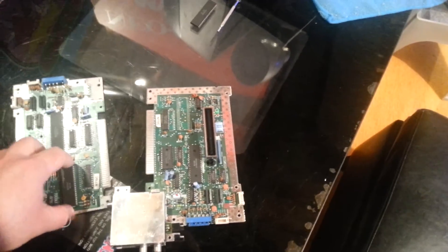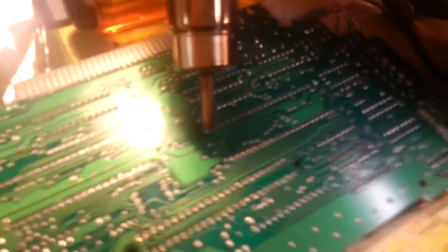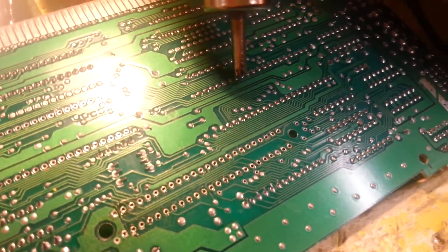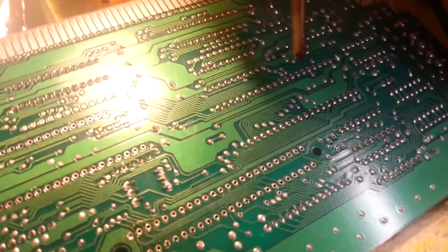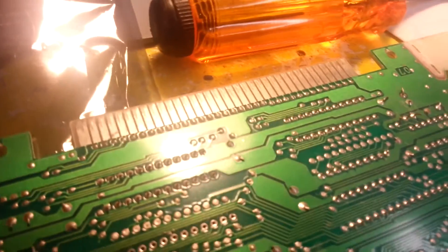When it comes to desoldering these chips, I want to show you a technique I found that works really well. Normally I use my desoldering gun to do it, but what I've been doing now is I take my rework station, use the hot air, holding the hot air just before the next pin that I'm going to do — I just keep sucking the solder as I go along. I'm able to remove it really quickly and easily without mangling any of the pins of the chips or lifting any traces. Having one of these is great — I can't recommend it enough.